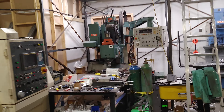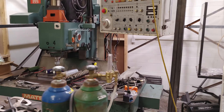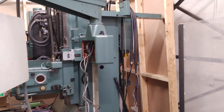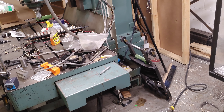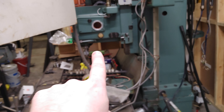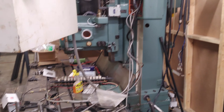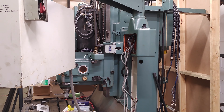So you might remember this milling machine — I refurbished all the electronics on it and gave it a real good cleanup. But it had an 80s control and it just couldn't keep up with modern G-code. A lot of modern G-code uses a lot of linear moves and it just couldn't process those fast enough to actually be a fast mill. But it's got a gearbox head so it'll do up to 6,000 RPM, and the low speed's got a ton of torque. The motor is about 8 horsepower — it might actually be 8 kilowatts, so 10 horsepower.